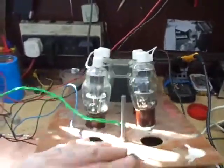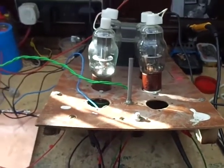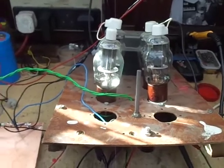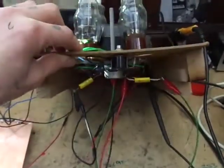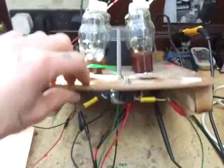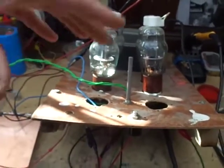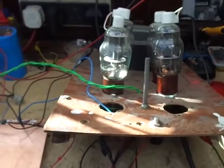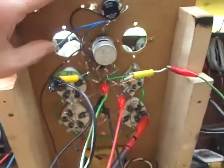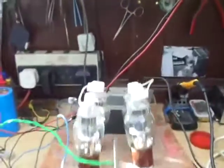This pot here is just dictating how much negative bias voltage there is. At the moment I've got it set very low at minus 42 volts, which is lower than it will actually be on the final amplifier. That's basically because I'm just doing a few DC tests — I only wired this up yesterday and I'm making sure that DC is where it should be, I've got the correct heater voltages and all the rest of it.